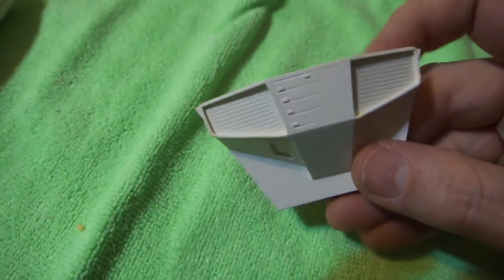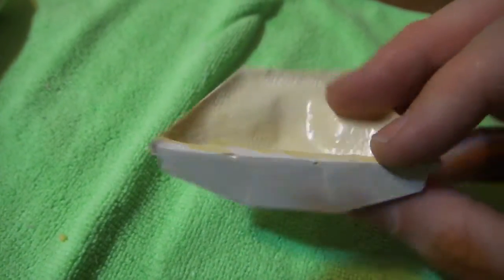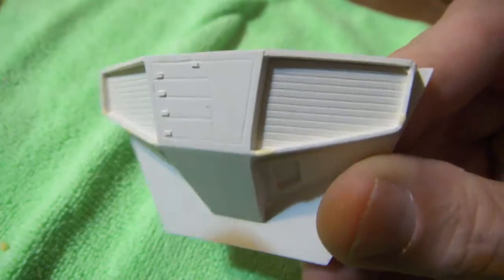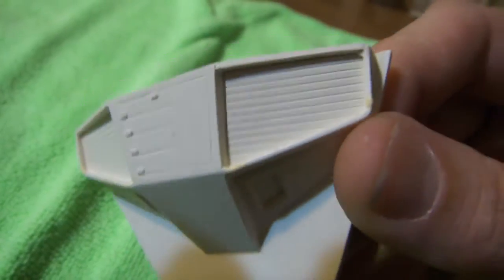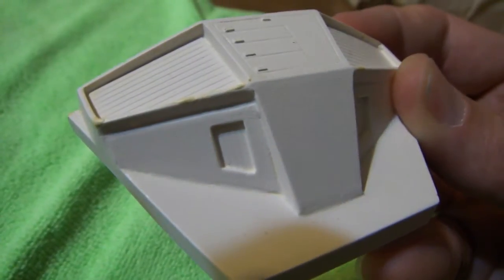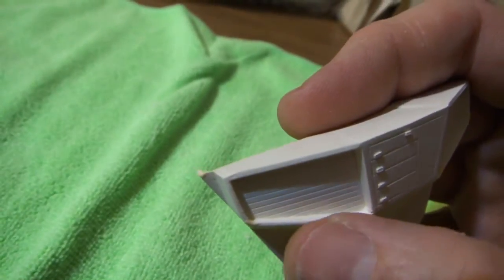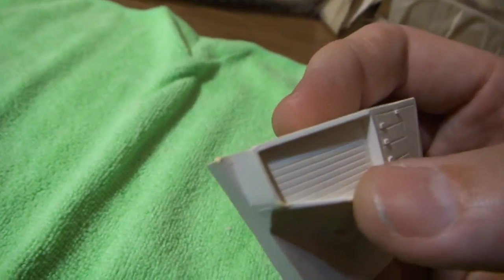Now this is the impulse deck, and it too is reinforced fiberglass, with fiberglass, the resin. And let's take a close look at this and see this part. Those etched lines are really nice and straight and true, very clean on the starboard side. Very nice. Those lines are real clean on the port. A little bit of mold release or something right here is a bump. It's not resin, it's something else. I'll have to clean that off, sand that down just a smidgen.